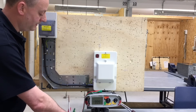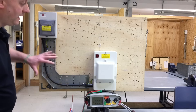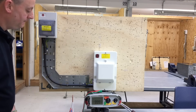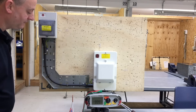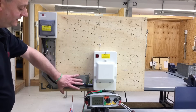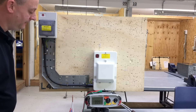Eagle-eyed viewers will ask why we're earthing the tray when it doesn't need earthing — it's neither an exposed nor extraneous conductive part. We've had that conversation with students and they're fully aware. The tray itself does not induce potential from outside and therefore doesn't require connecting to earth. However, the awarding body we're currently working for requires it to be earthed in their marking criteria, hence it has been earthed. The students are fully aware they didn't technically need to.